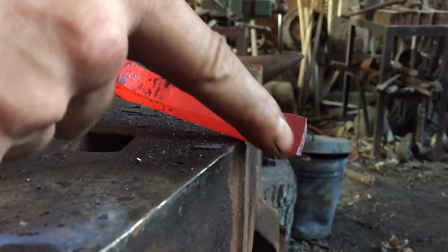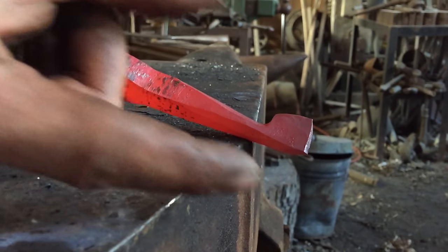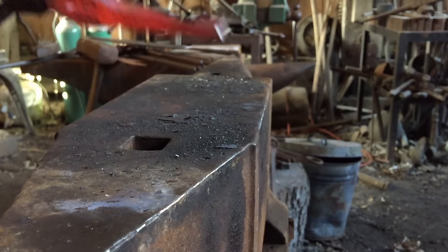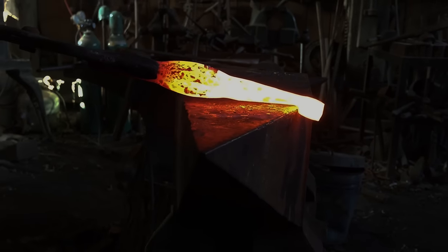Notice I move into the sharpest corner of the anvil and start wobbling. That technique helps creating that little tuck-in visually on the sides. You don't have to practice that at this stage yet, but later on it will give you the edge you need.